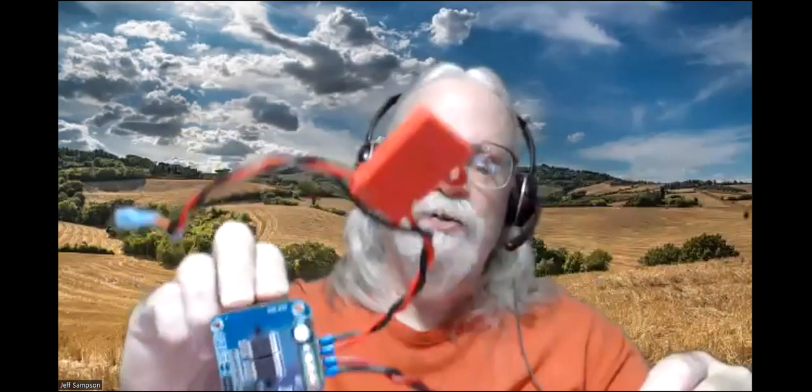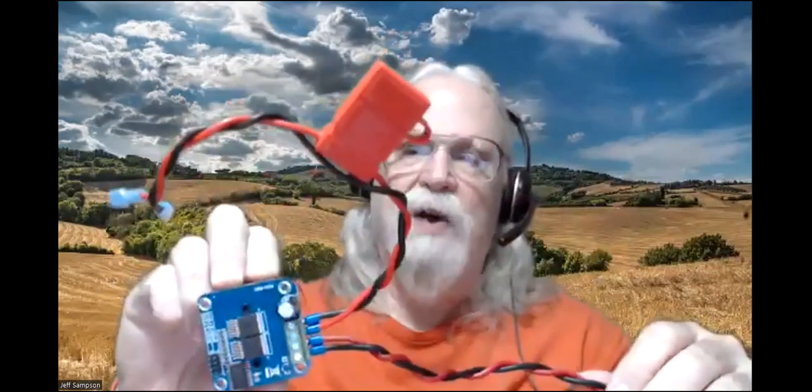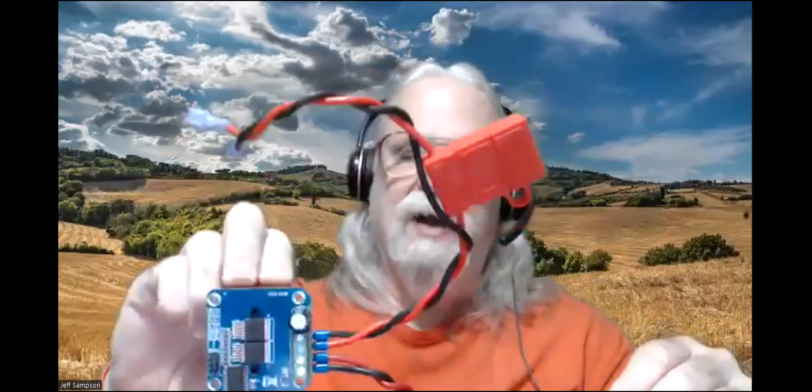And then I went through and, on the power lead, I just found a fuse holder and put connectors on. I can plug that into a lead acid battery. Then coming off the other one, I just put enough wire that I could lay this on the seat and plug it into the power steering motor. And my motor already has Anderson Powerpole connectors on, so I put those on.